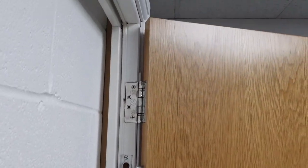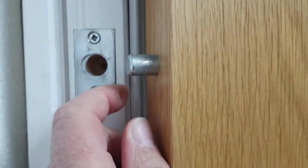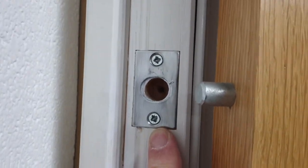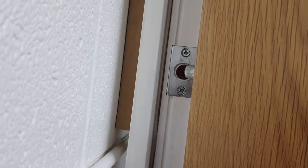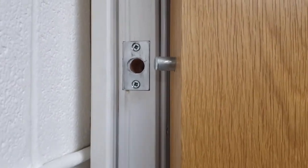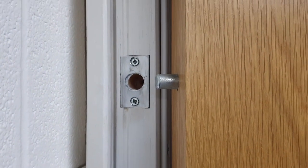The hinge bolts work as follows: a steel pin is driven into a drilled hole in the door edge — very rigidly fixed. A rectangular receiving plate with a corresponding hole is recessed into the door frame. As the door closes the pin engages in the receiving plate, forming a solid joint that provides additional resistance against someone kicking from the hinge side.